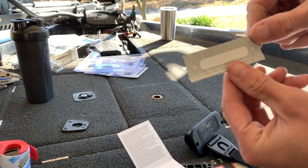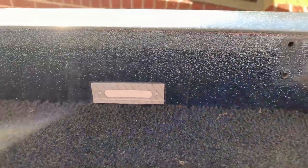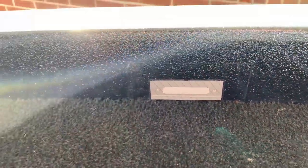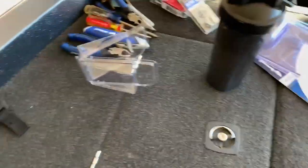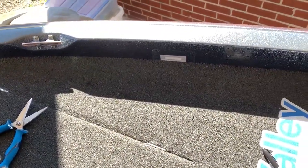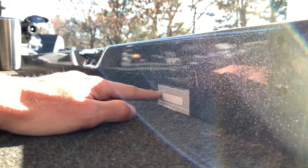There's your template cutout. I've taped it against the gunnel with clear tape so it won't move around while you drill. It doesn't really matter exactly where you put it — I prefer to stick it as close to the carpet as possible so it's not all the way up in the gunnel. I also measured across and placed it directly across from where my other one is, so hopefully they'll be symmetrical. Next, drill out the pilot holes on either side using a 1/8-inch drill bit.